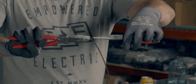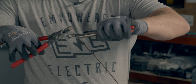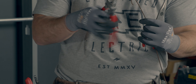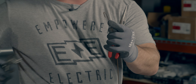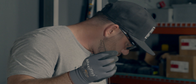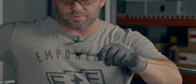You're grabbing it and bending it — you'll see why in a second, I promise. You bend it over, squeeze it down, grab it at the tip and bend a little extra curl in. You want it to be kind of pointy, rounded, and then have a little kickback right here, so that when you tie wire on it and tape it, when you pull it back it slides over. But sometimes when you bend it, it softens the metal and it breaks right there.